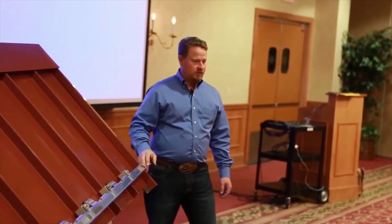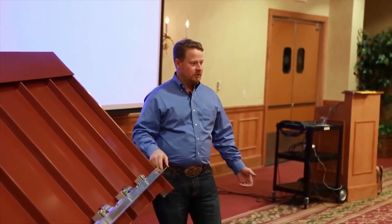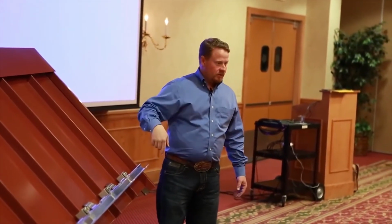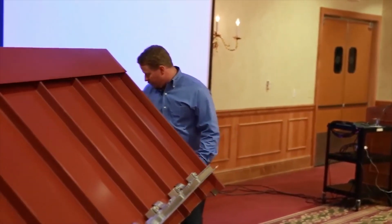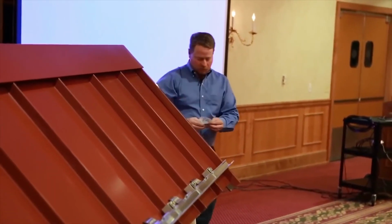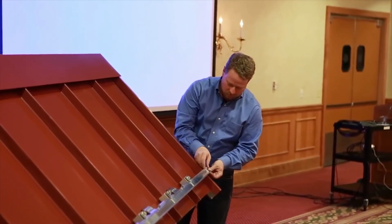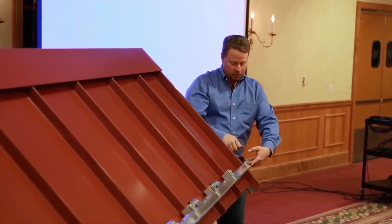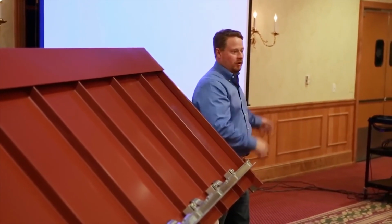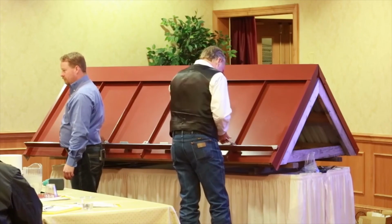The other thing you don't want to do is stop your joint with your ColorGard joint. Color strip usually comes in 10-foot sections because it comes out of a flat sheet that's 10 feet. I leave it in 10 feet instead of 8. So you run it through, you'll have a little bit hanging off here. You would come in then with your splice piece, and then you would take your next piece of ColorGard, preload the color strip through it, lock it into your splice, and continue on. ColorGard, we want it cut 4 inches from the end of a clamp.